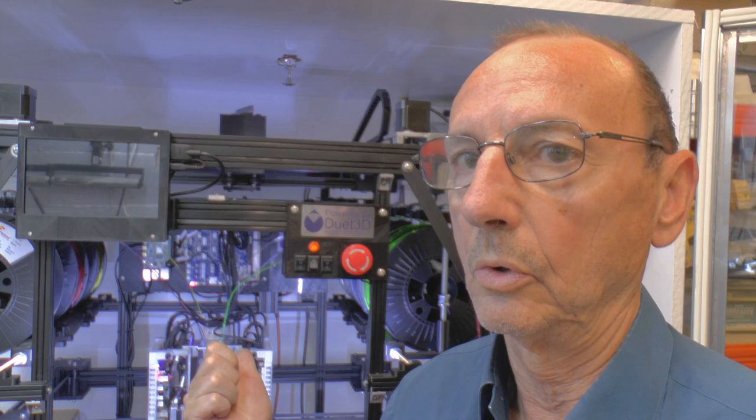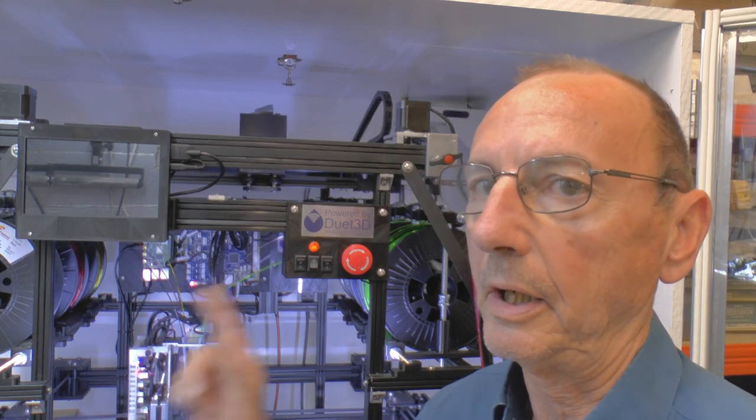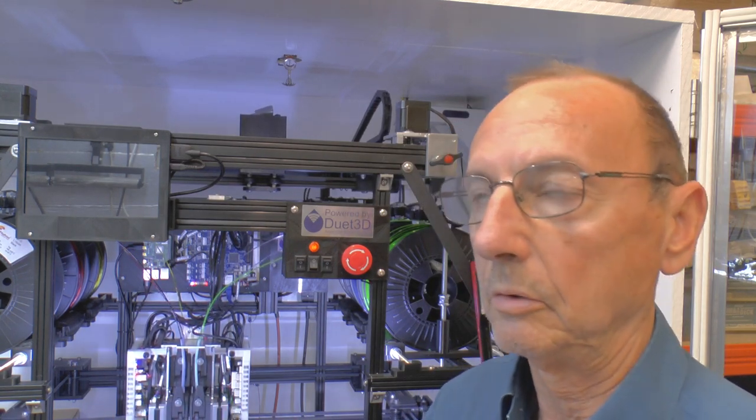So I came up with another little rule, which is if a hot end move is less than 1 millimeter, then it will move the XY gantry, and it's kind of to track these arcs. So any small segmented move will translate to the extruder gantry, but any move that's bigger than 1 mil, and it's actually 20 mil in X or 15 mil in Y, plus or minus, so any move that's within those parameters, it won't move. If it's less than a mil, it will, and if it's more than 20 or 15, it will. That is to say that if the end position is within those parameters of the start position, then it will move.